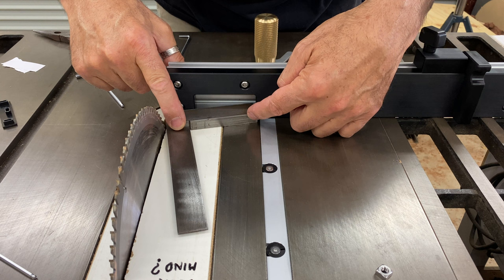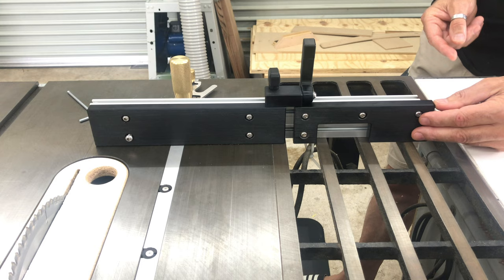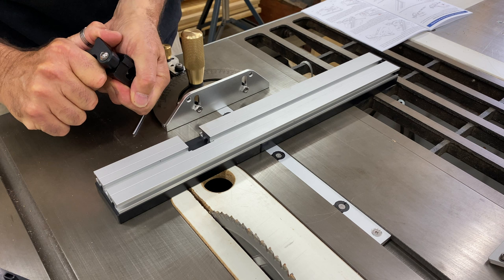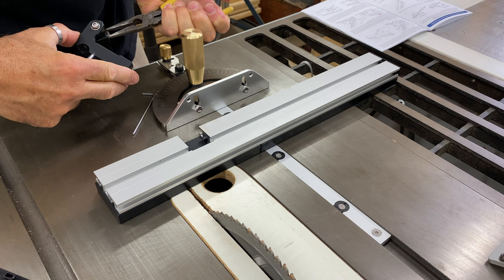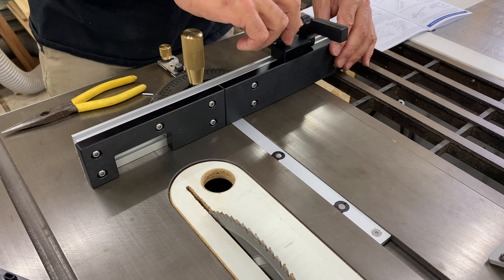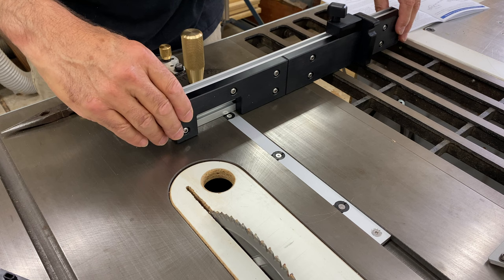I just swapped the plastic inserts to fix that gap. I also worked out that the cutout in the aluminium fence is for installing the T-track nuts for the positioning bars. The adjustable flip stop feels solid and is a great feature I didn't have before — it needed to be loosened a little to work smoothly and it did so without any play or deflection. The flip stop installs on a T-track on the top of the fence. Fitting the fence to the gauge was pretty straightforward, other than that cutout in the aluminium causing a little frustration whenever the T-track nuts had to pass through it.